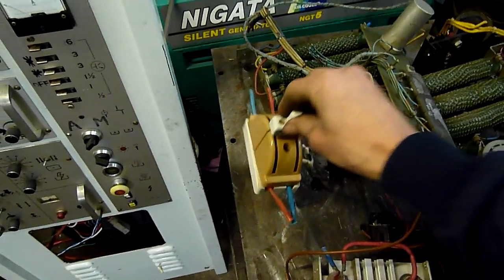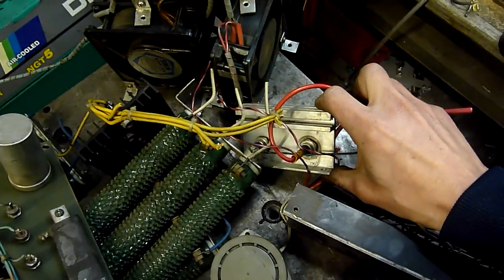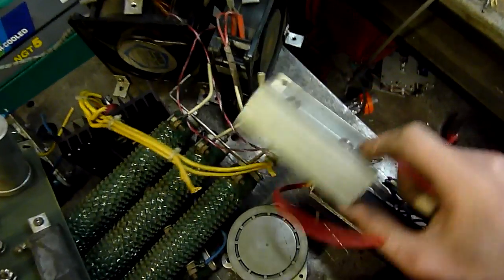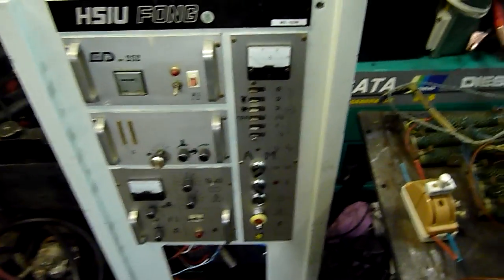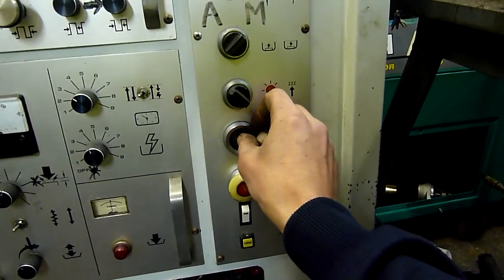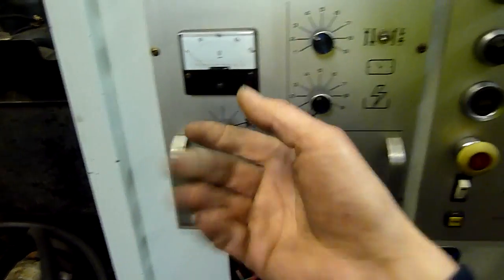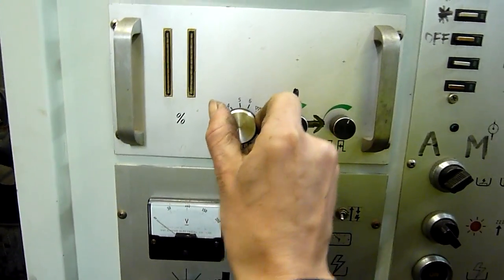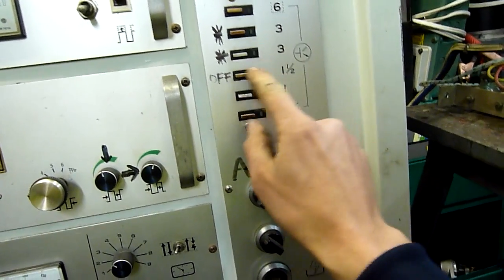It just changes the polarity depending on what material you're EDM-ing. There's a 240 volt buzzer, a couple of silicon controlled rectifiers, 120 volt fans - four of them - and resistors of various sizes in high wattages. The front panel still has everything on it apart from the DRO, which I've got. The stop and start buttons work - these are old switches but they still work. Potentiometers, fairly old and worn. The selector is pretty much trash - it never worked properly so we left it off anyway. Some of the push buttons are a bit mangled.